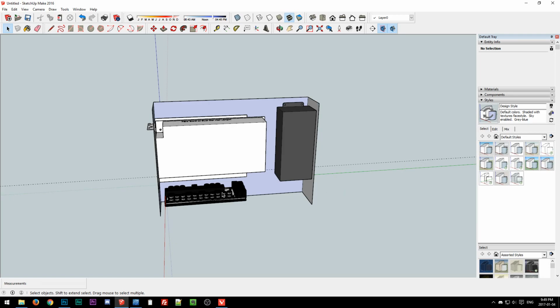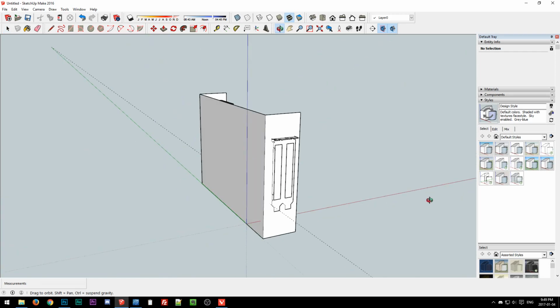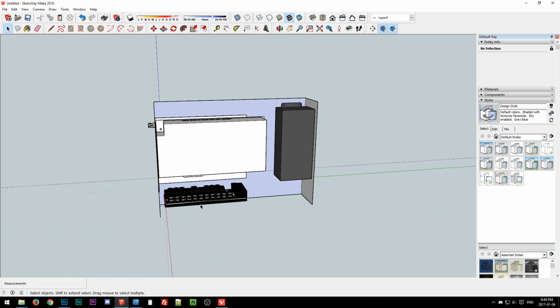And with sheet metal work, the fewer pieces, the cheaper, generally, to a degree, unless you have one super complicated piece rather than three really simple pieces that are just attached to each other. But other than weird situations like that, the fewer parts, the better. Fewer things have to be cut, fewer things have to be handled, fewer things have to be programmed into the CNC machines and so forth. So it's cheaper. The only problem is it's a little on the ugly side.